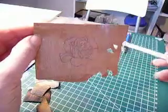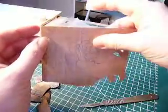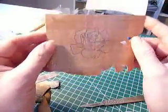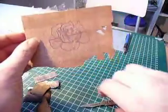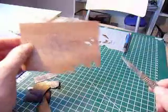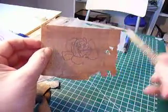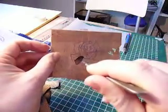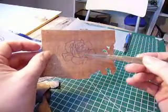I've traced my design onto this and covered it over with tape. I do that because this veneer's quite soft, but that's why I chose it - because it's soft and it's easy to cut. So I've got my copy of my rolls here. What I'm going to do is cut out a window, from the window method, cut one out, find the corresponding part, and then insert it in. And I'm going to do that for all these parts.